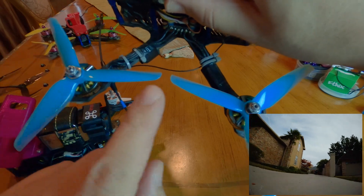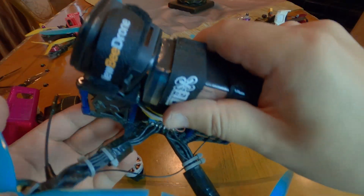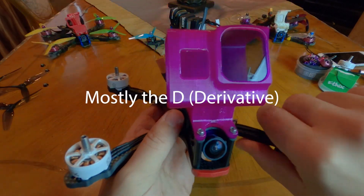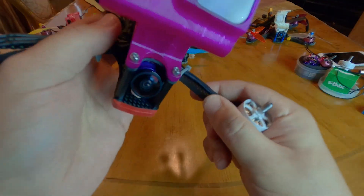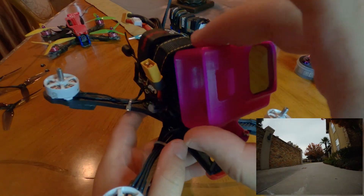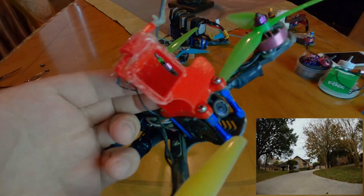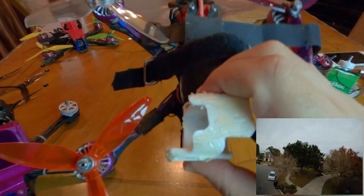The motor-to-motor distance is a little further apart - maybe five to ten millimeters. I used to want motors as close as possible, which is great on a small nimble light quad, but with a little extra weight and motors further apart it performs a lot better and is easier on the PID controller - the P's don't have to work as hard. It just feels better. We also have the Brain 3D mount. I used to use Brain 3D when I first started, but through obsession with cutting weight I ended up printing my own tiny mounts that save 10-15 grams - but they break.